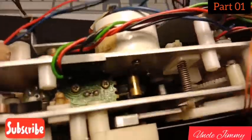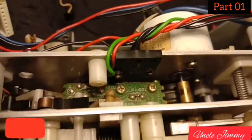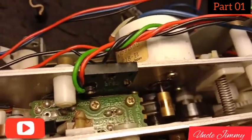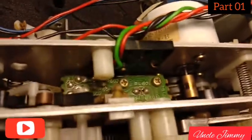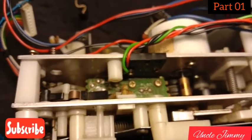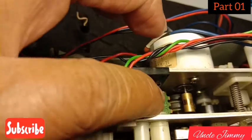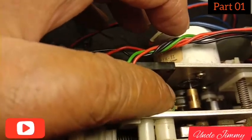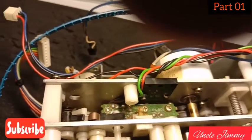I've inspected the rest of the transport. I'll be removing quite a bit here because this deck needs a new idler anyway — you can see in there it's actually quite worn. We've never tested it because it came damaged. Whilst I'm in here I might as well replace it. Those don't look that old — this is possibly not the original idler that came with the deck some 30-plus years ago. Usually those ones turn rock hard, and this one's pretty soft, but there are signs of wear and some indentations, so I might as well change the idler since I'm going to be looking at everything in this deck.